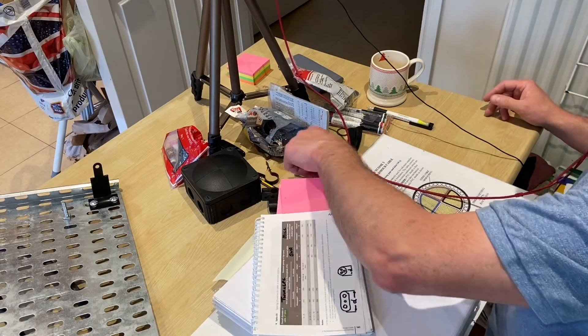Cable tray - good. So we've got a piece of cable tray here, and we're used to seeing loads of steel armoured cables secured on basket tray or ladder racking. Ladder racking is considerably stronger and can have larger armoured cables on it - it looks exactly like an aluminium ladder at the side of your house. Basket tray tends to be used for PVC twin and CPC cables running through an office ceiling. How are we going to secure armoured cables to cable tray?